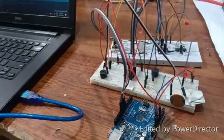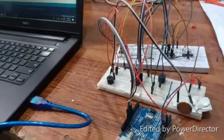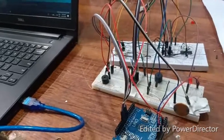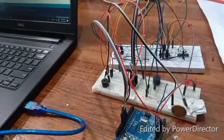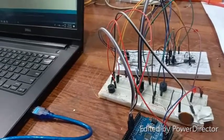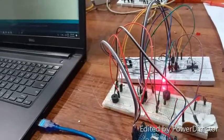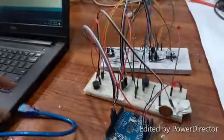Now guys, I will be connecting it to the laptop to power this system. It will beep, and firstly I will send no signal on the LDR, which means that it is always low. So the four bits received will be zero, and zero will be displayed. Next time I will be sending 0100, which means four, and this white LED will turn on. Let's see how it works.